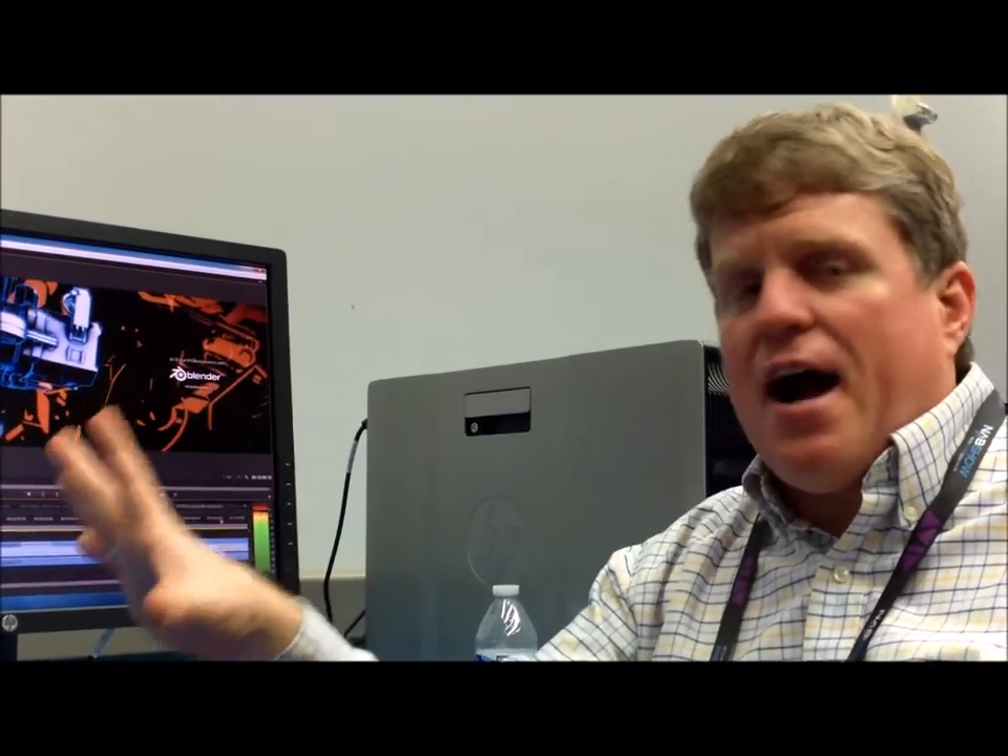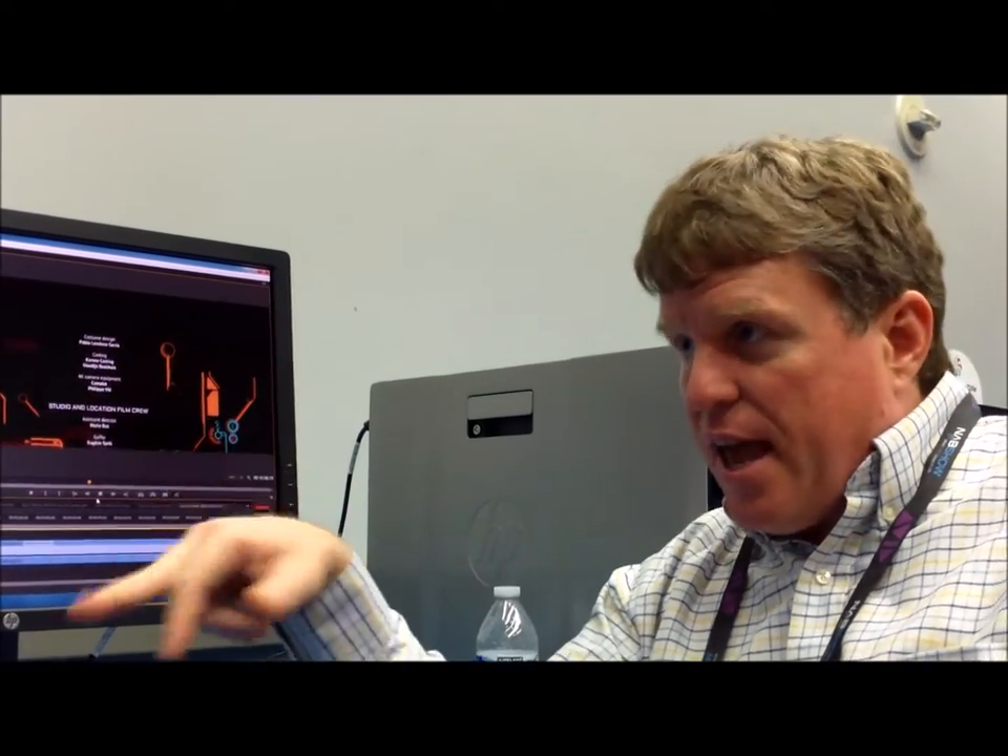The scaling gives a really nice-looking image for composition and color-accurate viewing of proper lighting, especially on set. If you want to look at tight focus for critical focus checking, you can engage one of our pixel-for-pixel modes to zoom in on an area of interest in the frame. We decided that's a good approach for this interim time before 4K becomes truly viable and color critical. The display supports 4K input at 24fps for film workflows, and also 3840 wide at 30 for video.